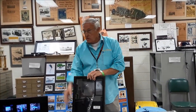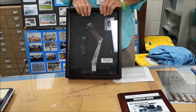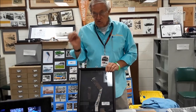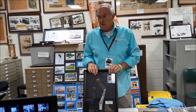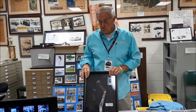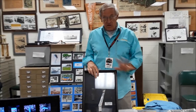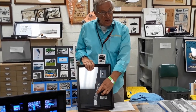What happens when Chrysler wanted this style shifter with the pistol grip, they gave us all these drawings and said we want this mounted on the Hurst stick. The Hurst stick, as you can see with the logo on it, is three-eighths thick. The pistol grip sandwiched between the grips is five-sixteenths. In numbers, that means it's a sixteenth of an inch difference. That's what they wanted — we could not change it. In order to get the OEM contract, we had to make it to their spec.